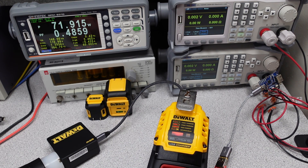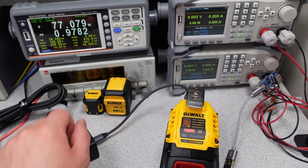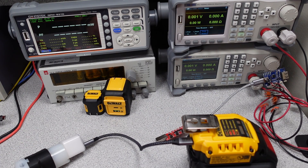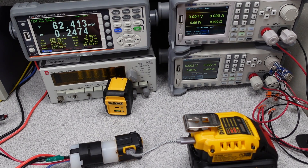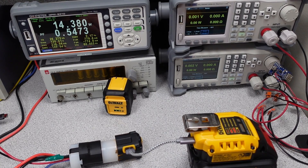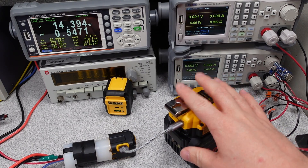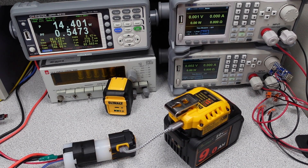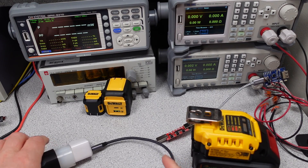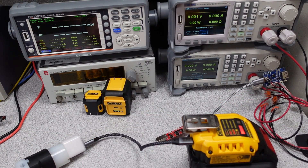Dream features would be a non-interruptible USB output, an extra USB-C port maybe at 30 watts, and a more advanced display. I like the concept though. This will charge from any USB voltage — I tried with several adapters including larger and smaller ones. A 9 volt 20 watt adapter works fine; even the DeWalt 12.5 watt 5 volt only device works — it will charge slower, but it will charge regardless. The best thing is that the battery is replaceable and interchangeable, so when the pack is tired, you swap another one in. You don't have to wait for the whole power bank to charge up. I can see this creeping into some projects, and if the price point was a little lower and it was sold independently, it would be much more compelling.